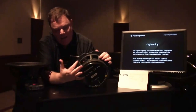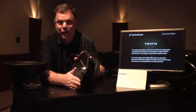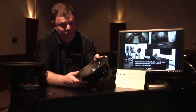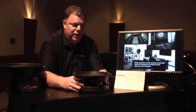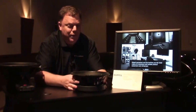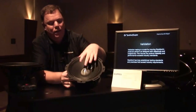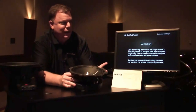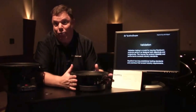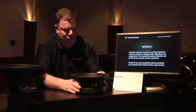We've added convenient spring terminals and our flex fit mounting that we use on all of our product lines for flexible mounting hole patterns. The cone is ultra lightweight, Kevlar reinforced paper cone with a treated cloth edge, and this is a solid machined aluminum phase plug. It really helps with power handling. We conservatively rated it about 350 watts RMS on the power handling for this 10-inch woofer.